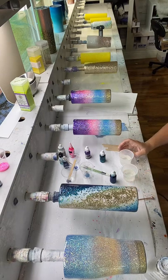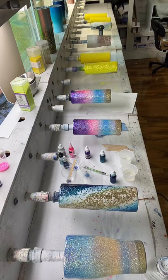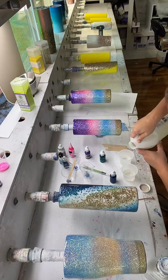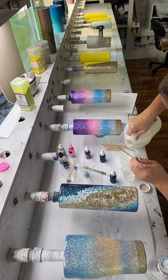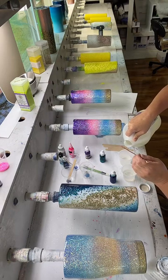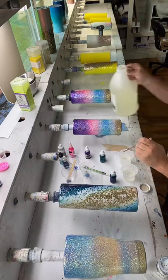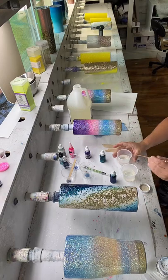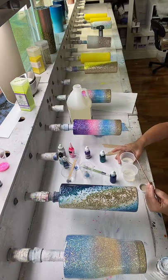All right, I need to add a little more to that one. It's funny, I can always tell which epoxy I poured last, even if I don't measure my cups, because, and this is speed dry epoxy, whenever you're pouring this epoxy, stop pouring part B just before you're even, just before you get even with it.